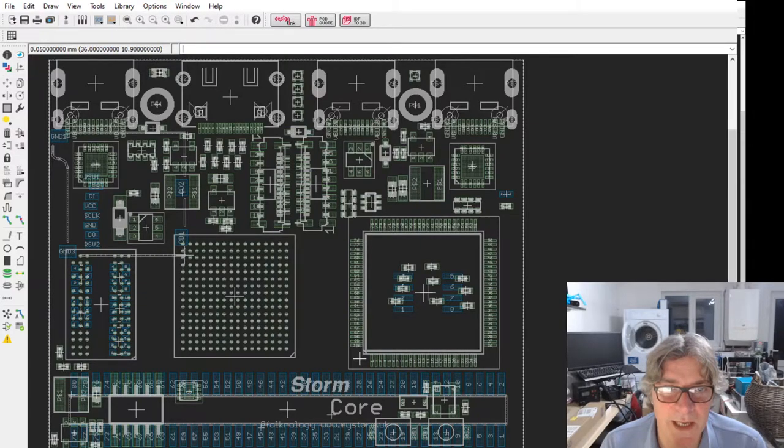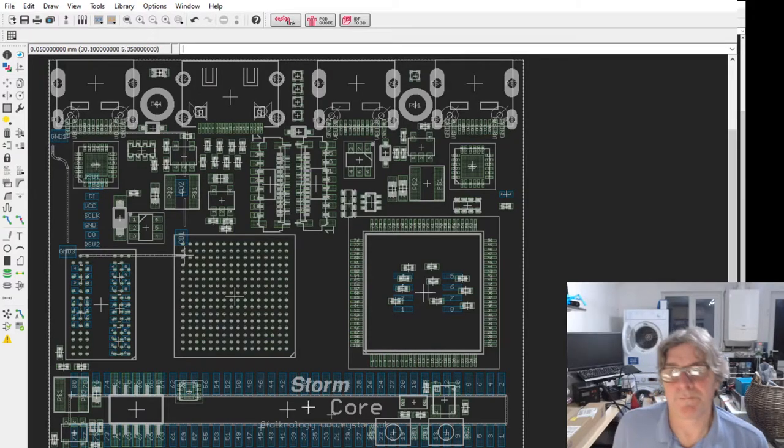In addition, we have 8 ADC inputs which go directly into the STM32, which can go up to, I believe, if you're interleaving them, 7.2 megasamples per second, or 2.5 normally if you're not interleaving them. So it's actually got 3 ADCs on board, and you can spread that over the pins. There's a couple of buttons. The STM32 has both a low speed 32 kilohertz RTC oscillator and a high speed, probably 25 megahertz oscillator.